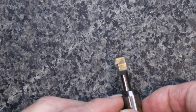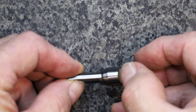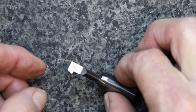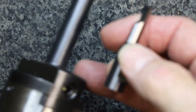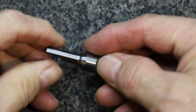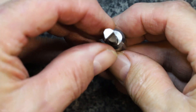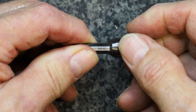I can make this tool — I actually made this one on my tool and cutter grinder. I even wire EDM'd this flat here so I could use it in the boring head, like one of these ITS boring heads. I put this tool in it and the set screw comes from the back side on these, which lined up the cutting edge so that it was in a proper orientation to make the cut. That's that type of tool.